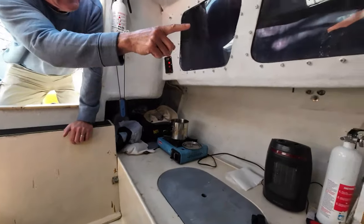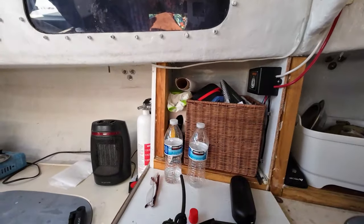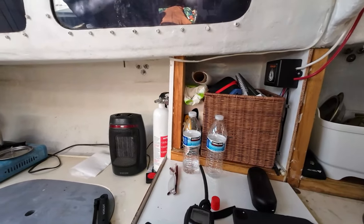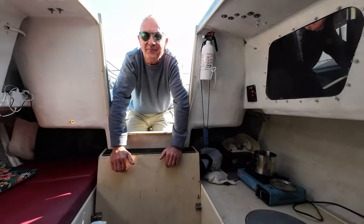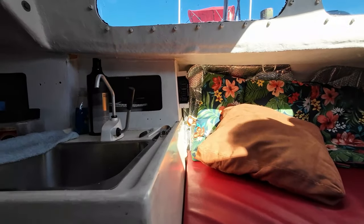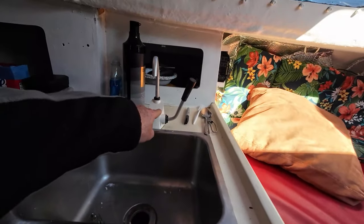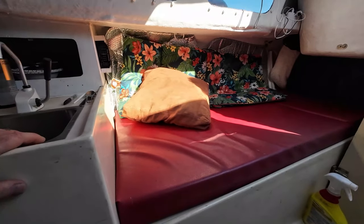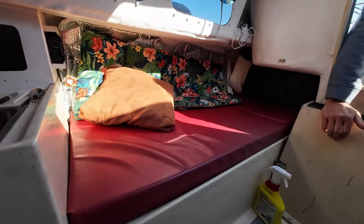I added these side compartments here to help stiffen the boat up because with the unstayed mast there's a certain amount of twisting motion on the hull when it's under load. Another reason I modified those is because when I took the stays off the old mast, I actually got another three-quarters of an inch of headroom because the deck moved up that much. So I needed to fill in above these compartments to make them structural again. We've got ourselves a nice little sink — the very same pump I have, a little Whale. And you've tucked in a little bit of insulation here, just because that's where you sleep.